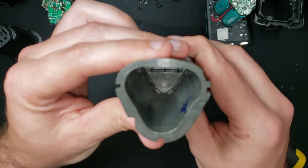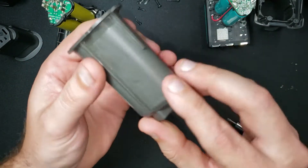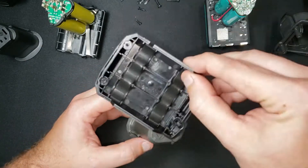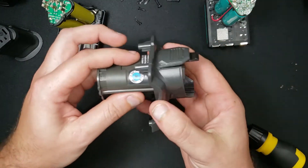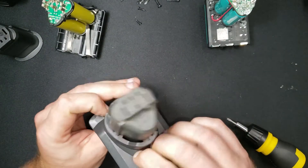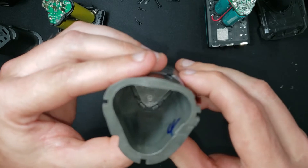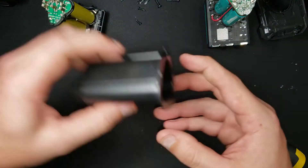Nylon 6 is not the most common nylon — the most common is nylon 6/6. You'd use nylon 6 instead of 6/6 when you care about surface finish and colorability. Since this is an exterior part, they want it to look good and be more durable than PC-ABS. It's also sticking out, so if the battery is dropped this is a less supported area — hence the stronger material. This part also meets a different flame retardant specification: FR17 versus FR40.